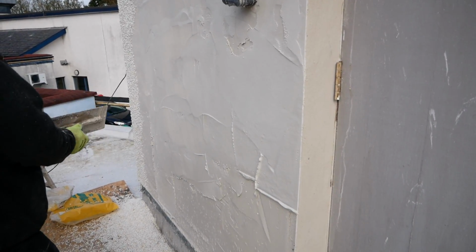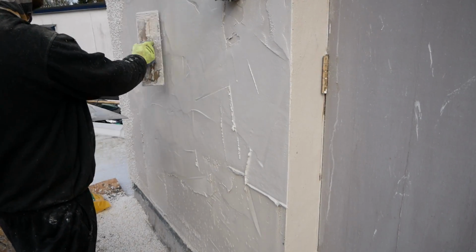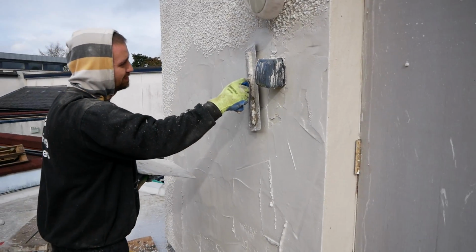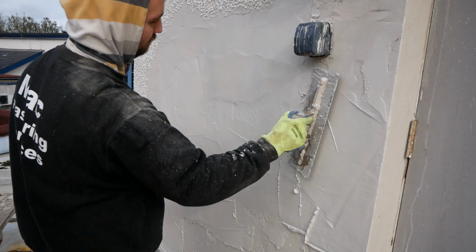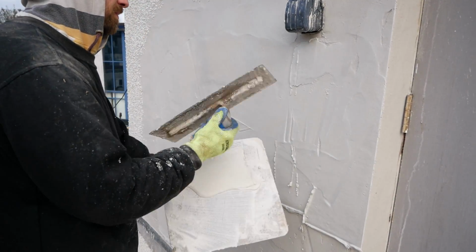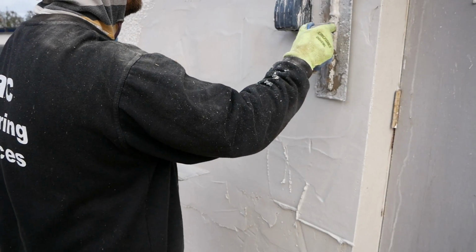We had it all chipped off, scratched it. I was very conscious, that's why I got the top dashed very quickly. I was very conscious of that red brick and the bit of wood and all the different materials up the top, whether I thought it might dry quicker at the top, so I wanted to get that smashed out and dashed quickly. Which to me is a good call, guys. If you're not sure, definitely wet it down and get it done as neat and quick as possible.